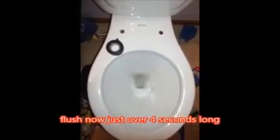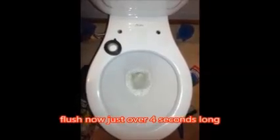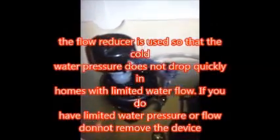New flush with just the hole covered over with electrical tape - a little better, a little bit. I had to replace this piece; the old one would not come up enough. I had to extend the filler tube with a little piece of one-inch PVC pipe. Also, if you don't want to sit there all day waiting on a toilet to fill, remember to check the inside of the fill valve.